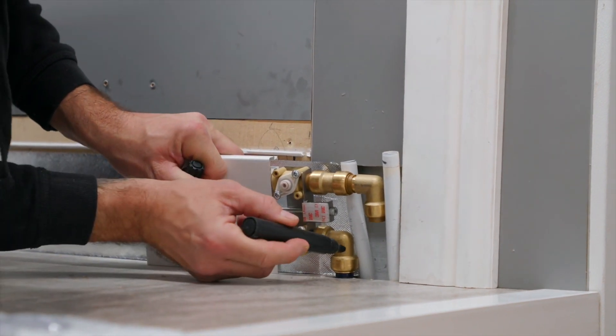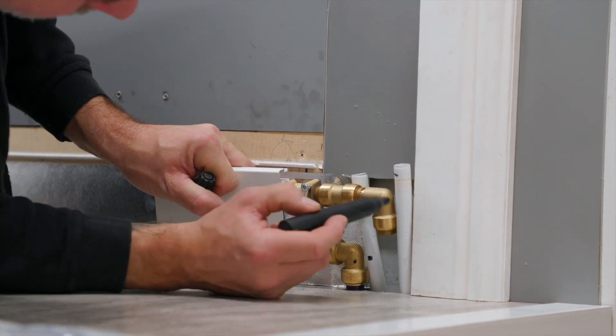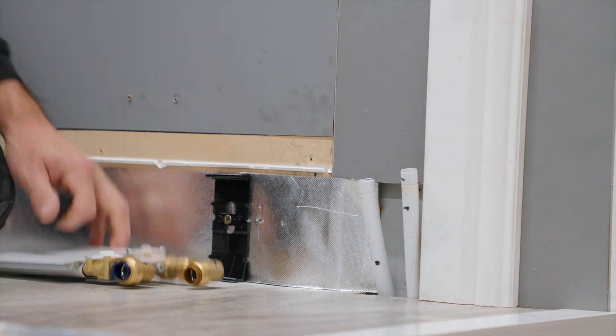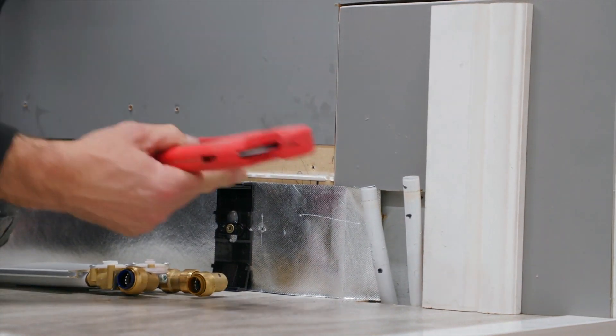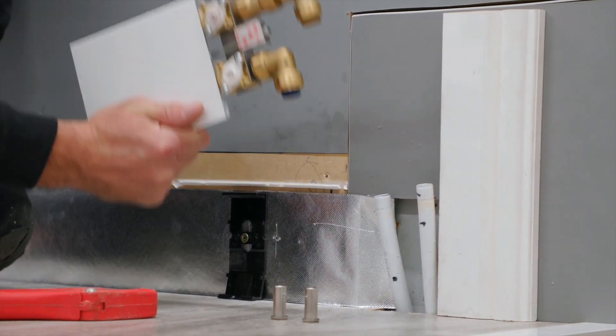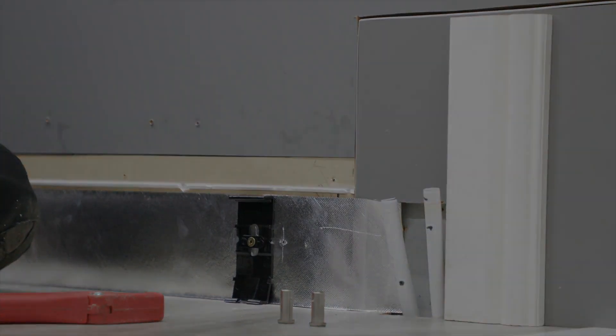I'm using a reference point at almost the top of the knuckle. You can mark the pipework using a permanent marker on both sides. Remove your template, then cut the pipe. Make sure to use the inserts — it's a must. Then fit the Tectites to the pipework. The Tectites will be tested.